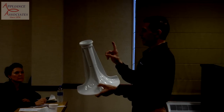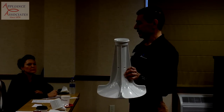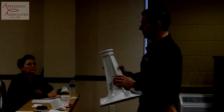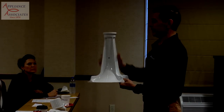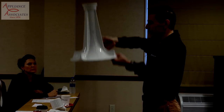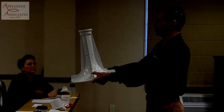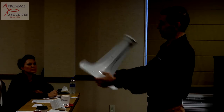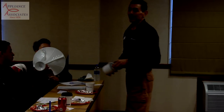But a few things. I've heard in some schools that they use these handles and they try to put them in here or in here, and they said that's where they were pulling from. This is on our prior model. The system is the same, okay? Meaning that if you pull from here and here, all you're going to do is cause the agitator to pull in and grip more. The reason you go below is because you help spread it and open it, because it's a pressure tab. I'll pass this around. Any questions about that? Or you can use the belt. Yeah, right. This one was exceptionally snug, so I'll make a report to the factory about that, and they'll change it, I'm sure, in production, or they probably already did.